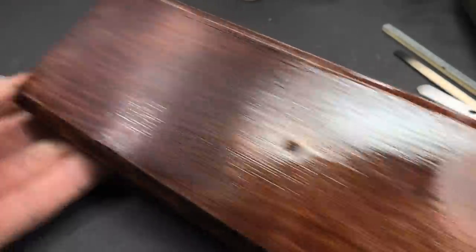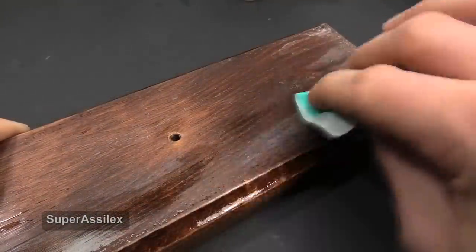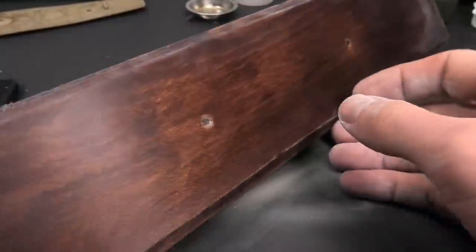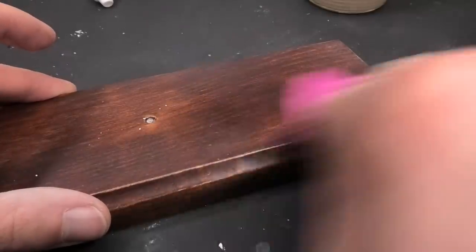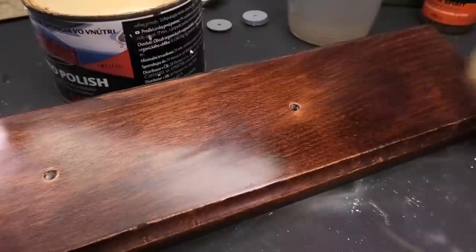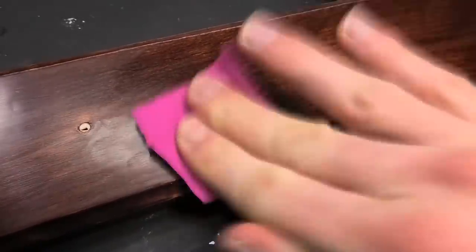As you can see the surface is nicely shiny but still very porous. I'm trying to sand down one layer of varnish so that all imperfections will disappear. I use smooth sanding cloth for a car paint job. This smooth semi-gloss coat also looks interesting, but I want to achieve a high gloss finish. If you have a car you can use the same polishing compounds or wax. After fine polishing the surface is nicely smooth.